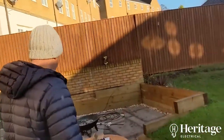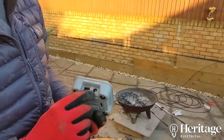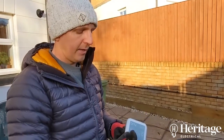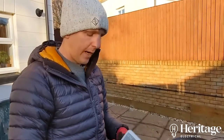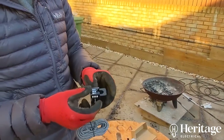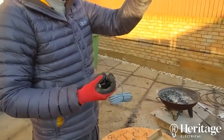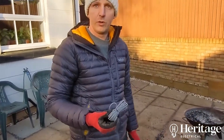Here's the hub — it's got a power lead and an ethernet connection on it. It will sit in the garage fixed to the wall; our ethernet cable goes into it, we plug the power supply in, and it then has the internet connection to wirelessly connect to the Zappi car charger. There's the little ammeter we were talking about — we clamped that around the main tail, the main live incoming supply from the electric meter. We're going to run another Cat6 and join it onto the end of that, which you can do up to 100 metres.